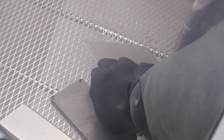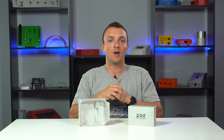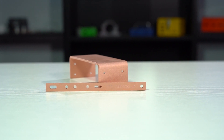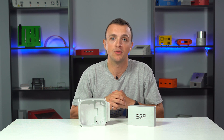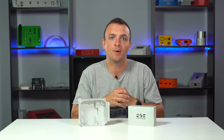In terms of materials, media blasting is most commonly used for aluminum, but we can media blast stainless steel parts as well. We've also tested media blasting on copper parts, such as copper bus bars. The end result looks very bright and sophisticated, but two very important things to note: for one, your media blasted copper parts will eventually corrode. Secondly, media blasted copper is very prone to fingerprints and smudges, so it's best to handle those parts with protective gloves.